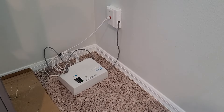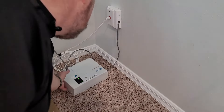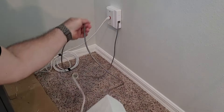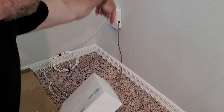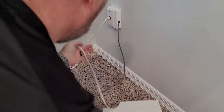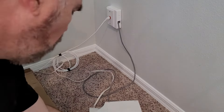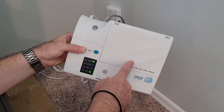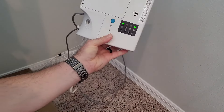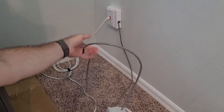In the corner of my family room is where the ONT power supply is located — it just needs to be plugged into a wall outlet. It's a power supply box; one wire goes out the side of my house down to where that AT&T box is, supplying power to the ONT. It could be in your garage or basement. Make sure that electrical cord hasn't gotten unplugged. Check if you even have lights on here. If there are no lights, it means the ONT is not getting power, or something happened to the cable between here and the ONT.